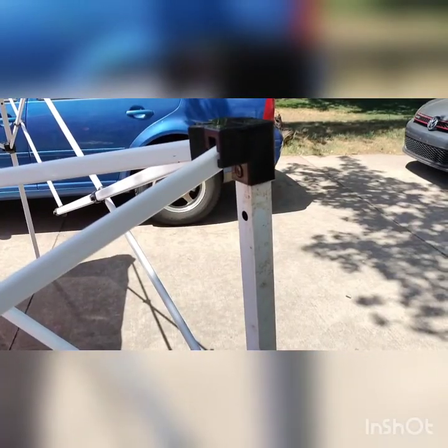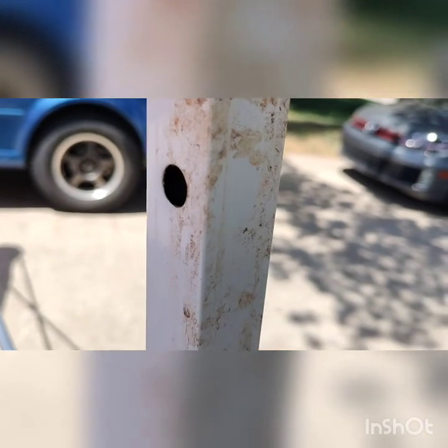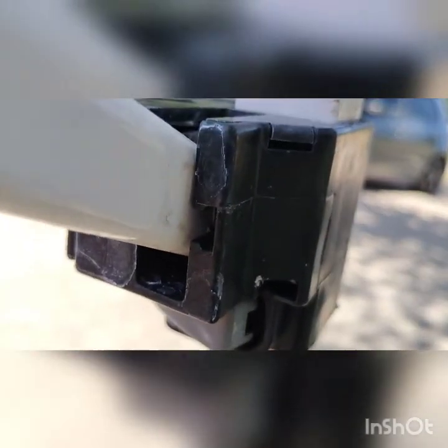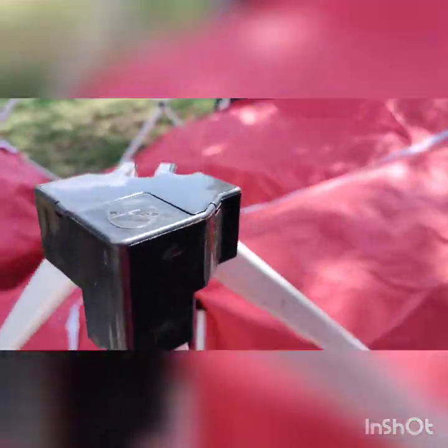Got the pole installed, got the pins back in, all seems right. That's the hole from the old pole — I need to make another one. I measured mine at about six and seven-eighths. Be sure to measure yours, don't take my measurements because yours might be different. I'm going to measure down six and seven-eighths for the hole on the side for the pin. Then I measured the holes for the velcro, drilled them — it looks like the others, so let's test it out.